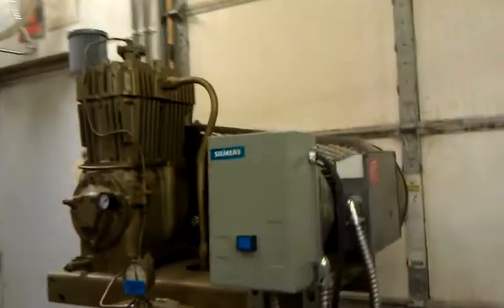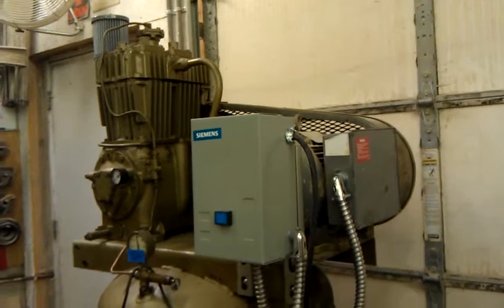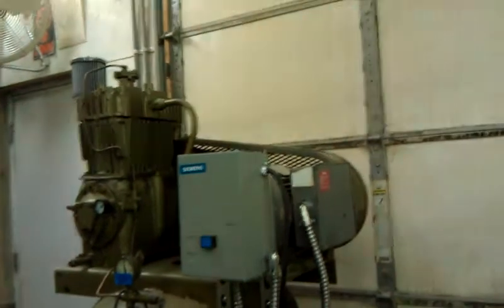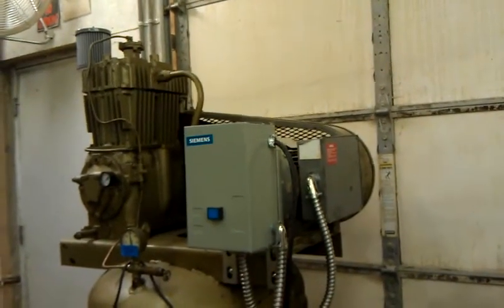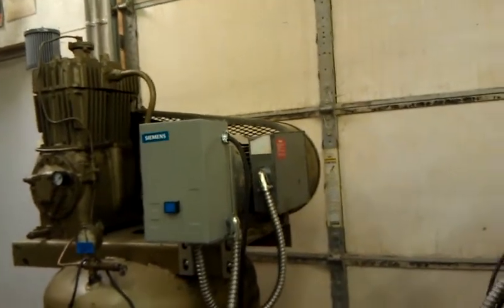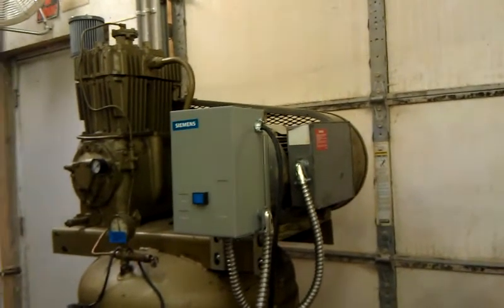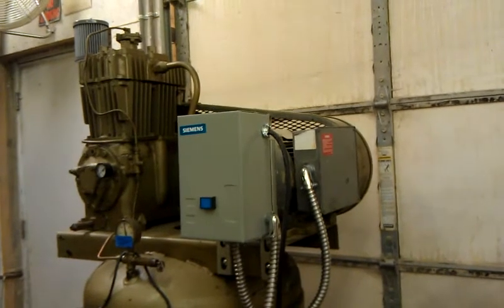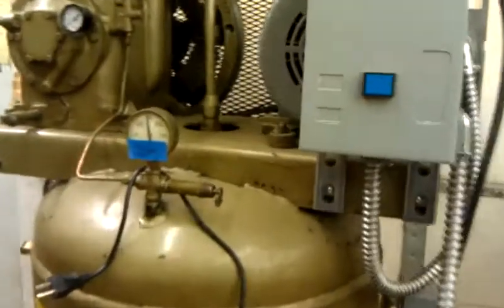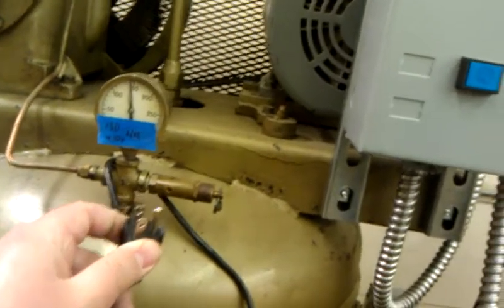Little did I realize it will still work to my benefit partially. Because this compressor pulls a higher amperage than I'm currently running, I need to pull a heavier gauge wire from the disconnect switch back to the circuit breaker box. In doing that, I'm going to pull two of the wires out but leave one there and turn it into a neutral circuit — tying one end into the neutral bar in the circuit breaker box and the other end into the neutral bar of the disconnect switch by the compressor.